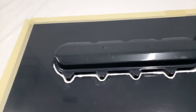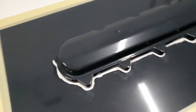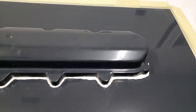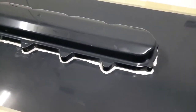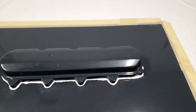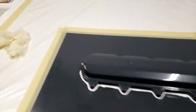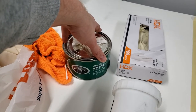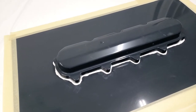I'd give that like a three out of ten. The clay just doesn't stick to the surface well — it has a tendency to lift off, and because it wants to lift, you have to leave it relatively thick. You can't get it real tight in there. I tried to shave it with a pick and it basically tears away. Get the filleting wax — try it out. I have enough flange that there shouldn't be a problem. I'm going to wipe it back down with cleaner and then start the waxing process using Part All Paste Number Two — about three or four coats, put it on, buff it off.